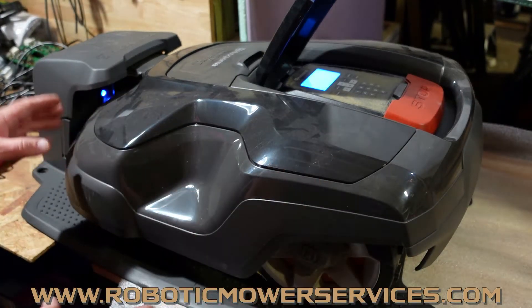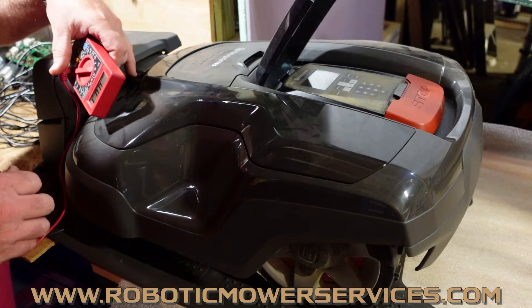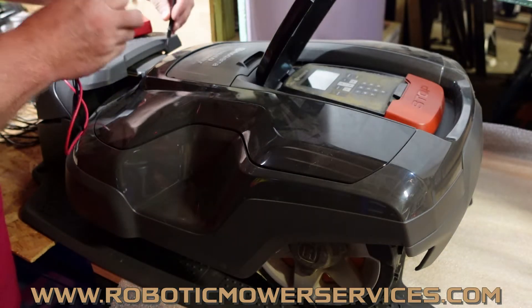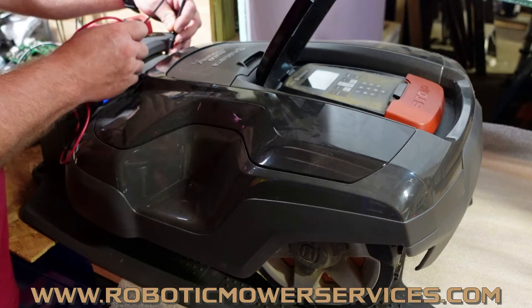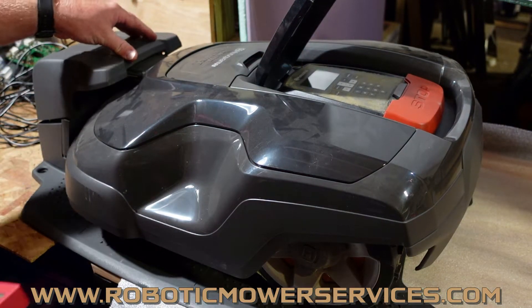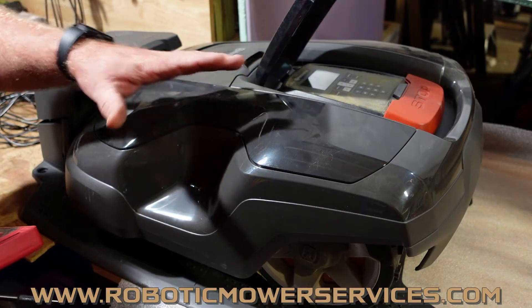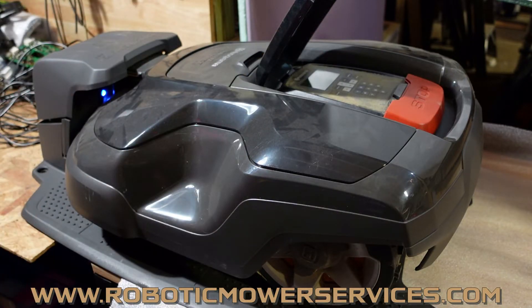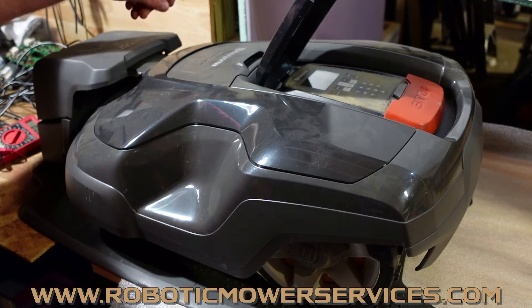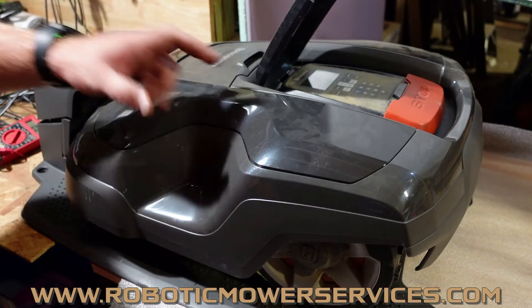If you get the disconnected tone but the LED is still lit up, check that you have power coming through the contacts and going into the nose contacts on the mower. With your multimeter, have the mower out far enough to check but still making contact. We've got 19.5 volts right there, so that is good. Anything between 18 and 20 volts is good — even 17 means the battery is really low and starting to come up. This is an 18-volt battery with a maximum of 20 volts, so that range is expected.